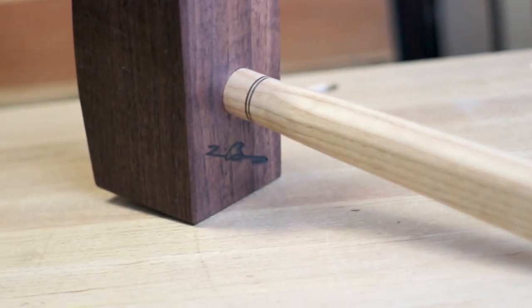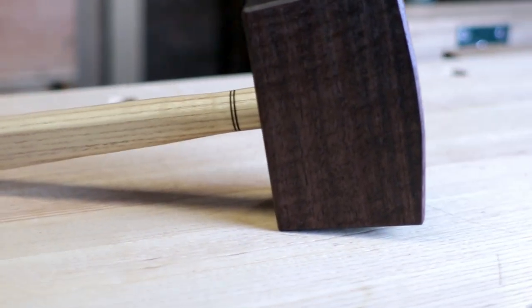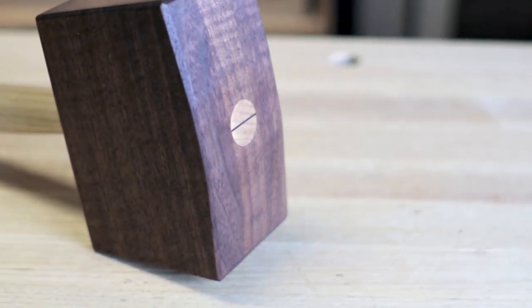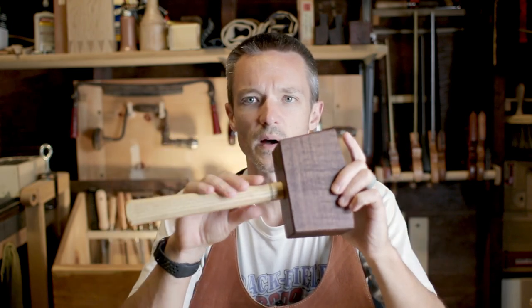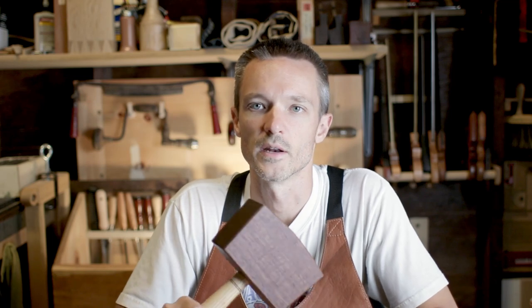And there we go — the finished project. It looks nice. I might be afraid to use it a little bit, but I'll probably put a piece of leather on one side and then start thumping away. Thank you for watching. Overall I'm really, really happy with the way this mallet turned out. I'm glad I added the extra weight — I like how it feels. I might line one of the faces with some leather, but other than that it is done. Construction was pretty simple, made even more simple by the circular tenon rather than cutting a square mortise in a big block. Thanks for watching. Don't forget to subscribe, follow me on Instagram at The Wireless Woodworker and on Twitter at The Wireless WW, and I'll see you next time.